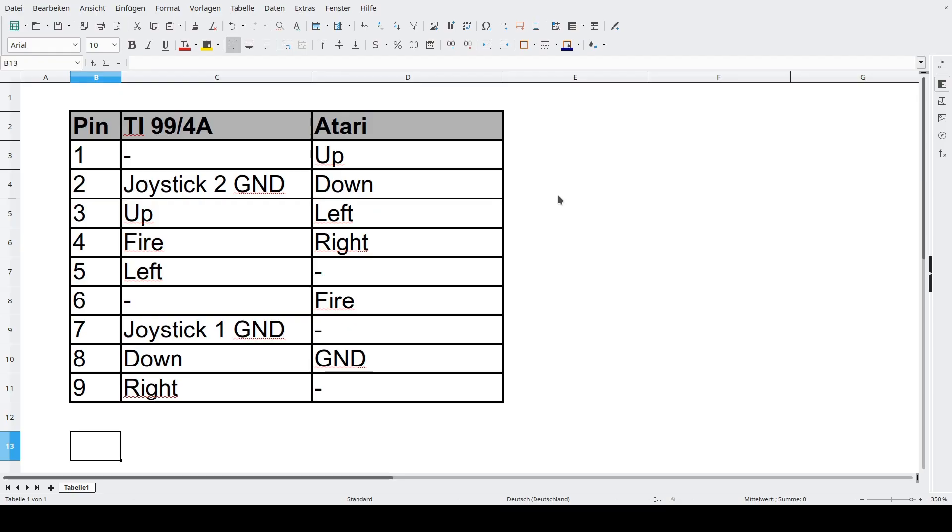So again, it's time to do something with the TI-99, which I showed in one of the earlier videos. Today I'm going to build a joystick adapter for it. This is why we need an adapter: the pinout of the TI-99 is totally different to that of Atari joysticks, although they both use DB9. Especially different is that the TI-99 has only one DB9 port for two joysticks, and the selection goes about different grounds.